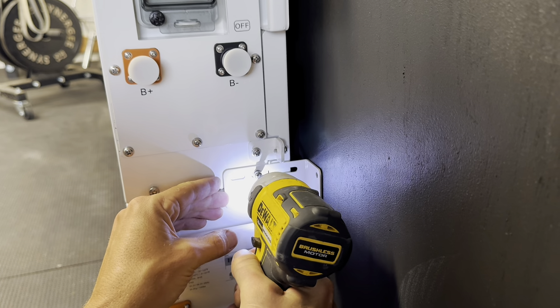When connecting the positive and negative wires from the battery, there's no need to put one positive on the left and one on the right side, but positive does go to positive only — very simple. I didn't, but I do highly recommend using ferrules on your wire connections. This right here is the communication cable that plugs into the inverter from the battery. You'll want to check out the video on configuring the Ethos battery controller to the Lux Power inverter — the little screens and the manuals make it very easy to do.